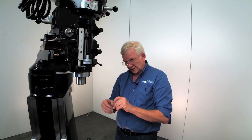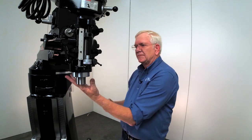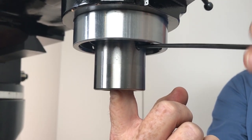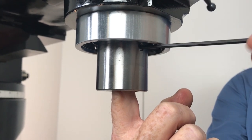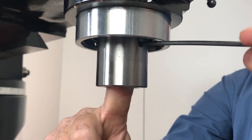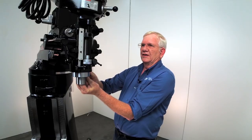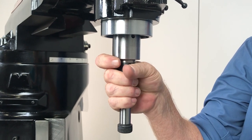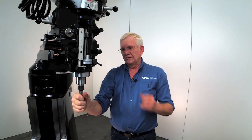Now what we're going to do is just reverse the process. I'm going to put that little set screw back in, make sure everything's nice and clean. Now I'm going to put my hand up in the spindle, have the collared alignment screw started in here — I'm just going to let that protrude a little bit before I set the exact positioning of that. You can feel it coming through or protruding out on the inside. We'll take that collar again and make sure it slips in there, holding everything in there nice and tight.